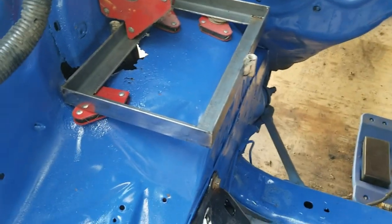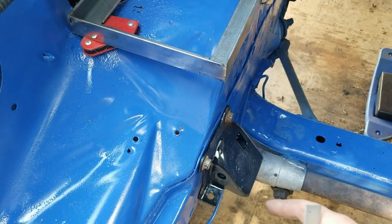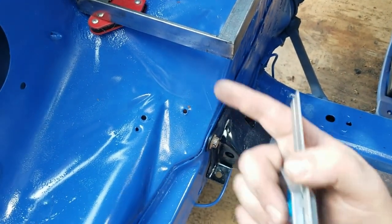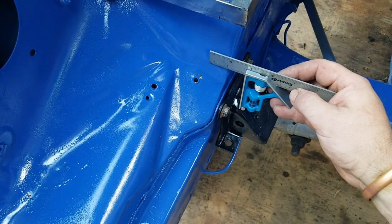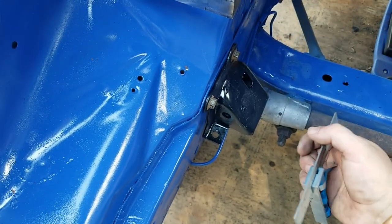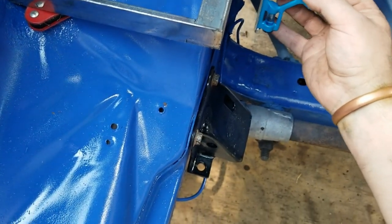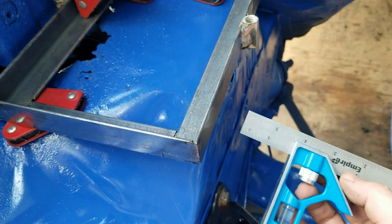I may have to rethink what I'm doing here. I put the motor mount onto the engine and measured up and over where the manifold sticks out. From the hole to the passenger side of the car is this distance to the edge of the manifold — that was like four inches back from here, and from there it only gets wider. So I think we actually have to cut into this fender a little bit.